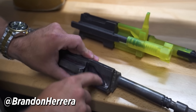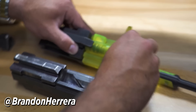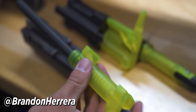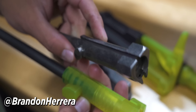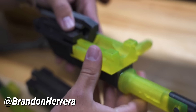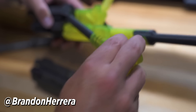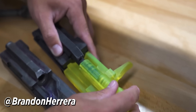We still want more lug contact in this track here. As you can see from the 3D print, we have significantly beefed up the lug by a lot. This is a beefy lug now. The contact area inside of this track — the cam groove on the bolt carrier — is significantly greater. We're hoping that's going to help us with a lot of our potential smearing issues.